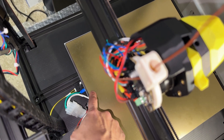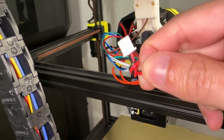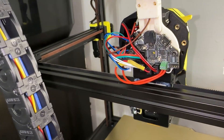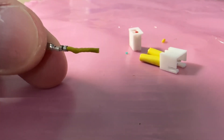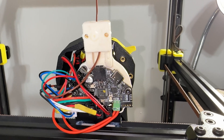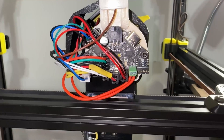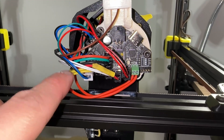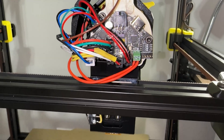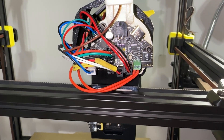You will have to readjust the bed and Z endstop again — that's why you need to leave slack in those wires. You can loop these cables to shorten them, but it's easier to wire them tight to begin with. The trade-off is you have no margin for error when crimping. For those going with the stock X and Y cable chain routing, your biggest challenge is running 20 wires cleanly all the way to the electronics bay. At the very least, use a breakout PCB to simplify future maintenance. You can then finish up any remaining wiring and set up Klipper.